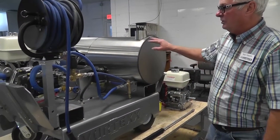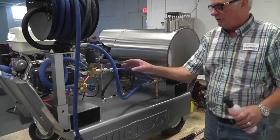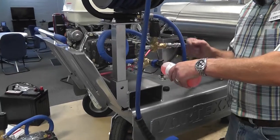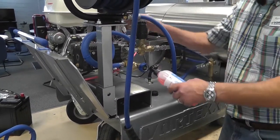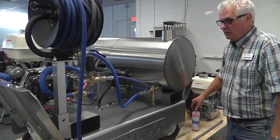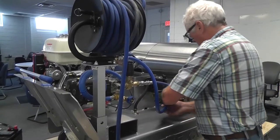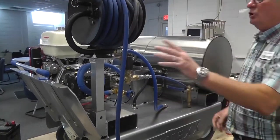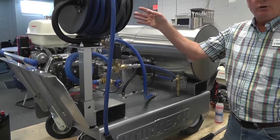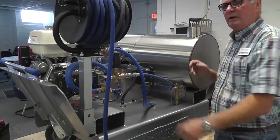It's very important on these hot water units and even all of our pumps that these things will absolutely freeze up in the winter if you leave water in them. On a basic pump, without hot water, we do the pump saver — take the cap off, screw this on right here, squeeze the bottle, pull the pump motor, and that will suck it into the pump. That's not enough fluid to do the whole coil though, as there's 80 to 100 feet of pipe in there. Our suggestion is: take a short garden hose, take a five-gallon bucket of antifreeze, hook up the garden hose dropping into the antifreeze, unhook the hose where it's coming out of the coil, start your motor and watch — as soon as you get pink or blue antifreeze coming out, you can shut down. That means you have antifreeze through the whole system.